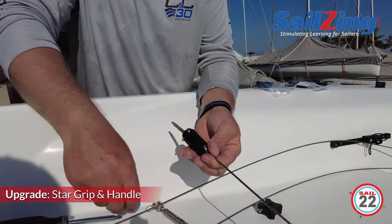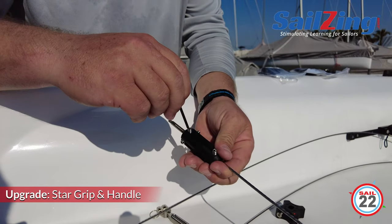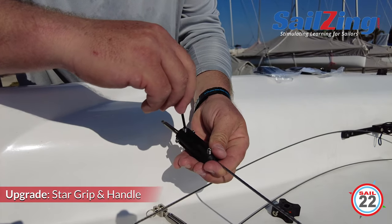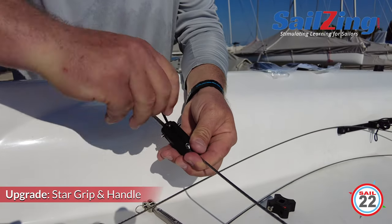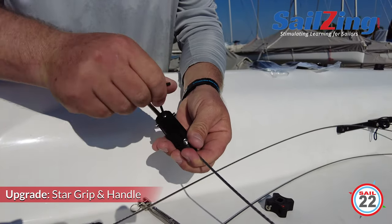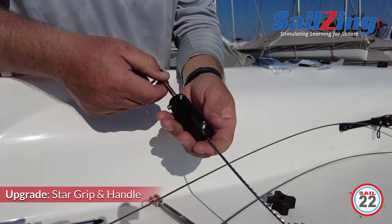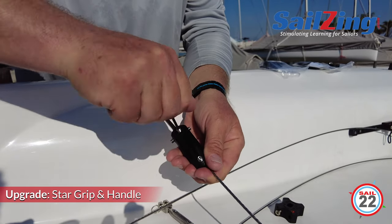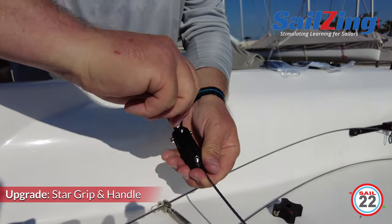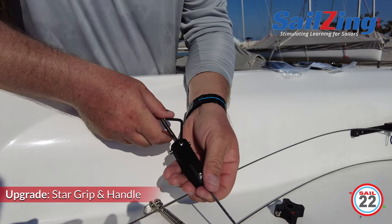So you just basically take the Allen key that's provided, and I normally make sure I get it on the flat here. And these grub screws don't come on, they come in a pack, so you do have to tee those up ahead of time. So like you said, you're lining up those set screws with the flat. Yep. So if you line up these ones first, you can then get it kind of tight, and then the other ones are just centering.